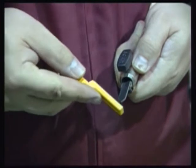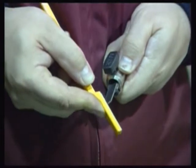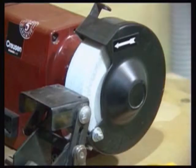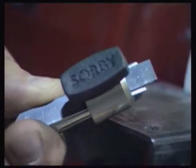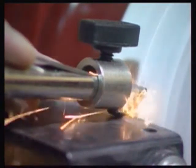The burr can be formed in several different ways. Using a diamond file will produce a fine burr on the cutter. Touching lightly against a bench grinder wheel will produce a heavier burr. If doing this with the cutter held in the tool, ensure that the cutter blade is withdrawn up into the clamp to allow only a small protrusion over the edge. This will ensure that the blade does not chatter as it is applied to the spinning wheel.